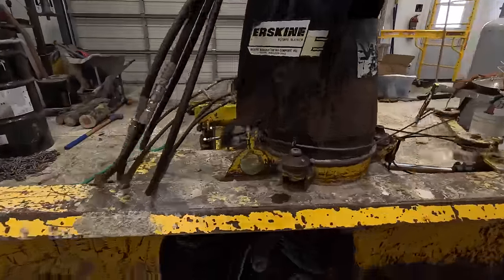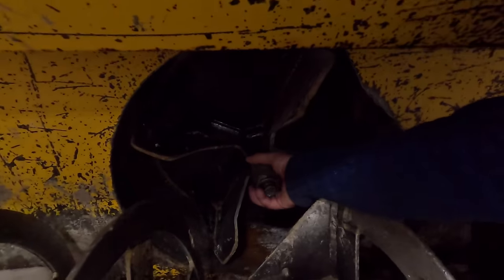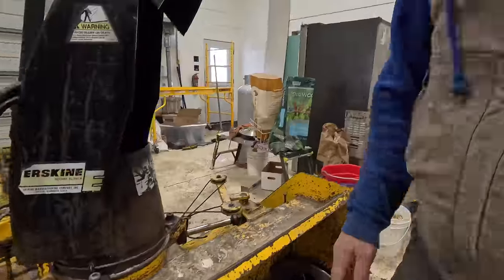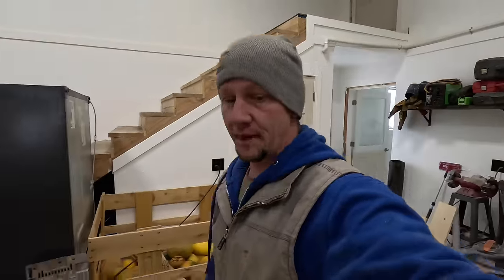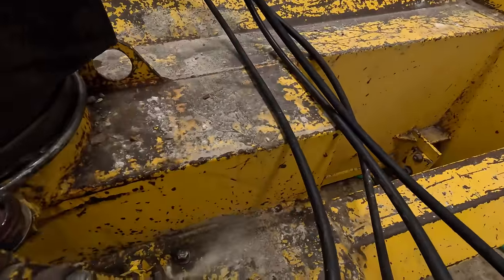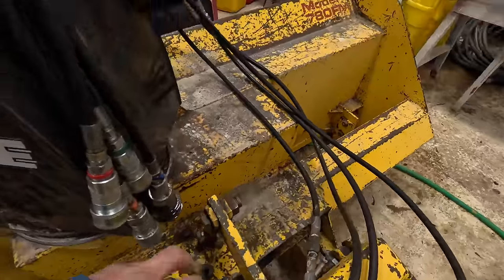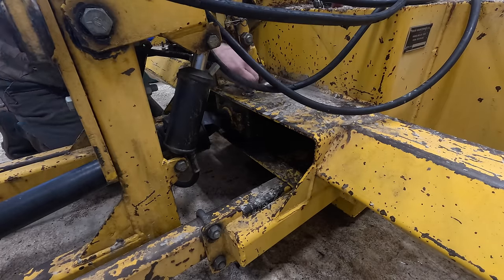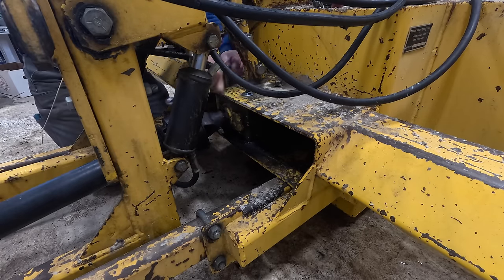One thing I did notice when I was checking things out is that. So initially I thought, oh crap, my bearings are going out on my impeller fan. But instead what I found is the gearbox bolts. I had 3 of the 4 in on the top and there's 4 more on the bottom. There's only 1 in there. So I had 4 of the total 8 bolts remaining. The others just probably loosened slightly from vibration from use. Didn't catch that they had gotten loose, vibrated out. So again, not a big deal. I'm not worried about any of this.